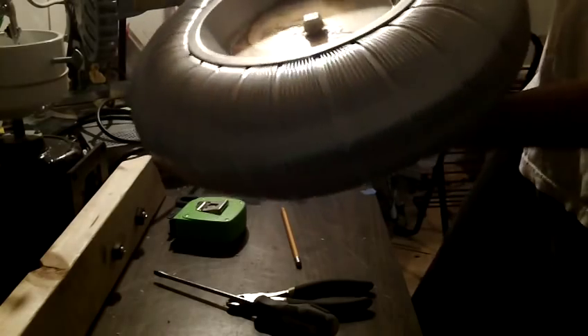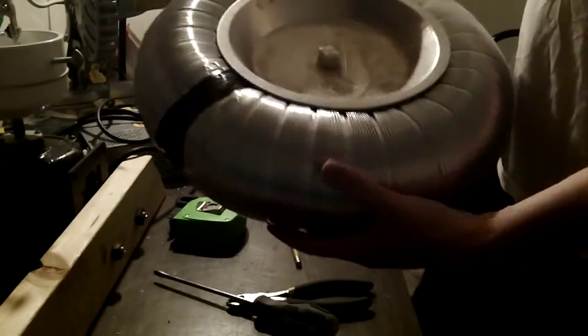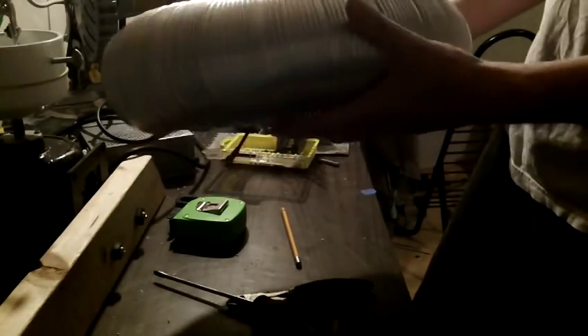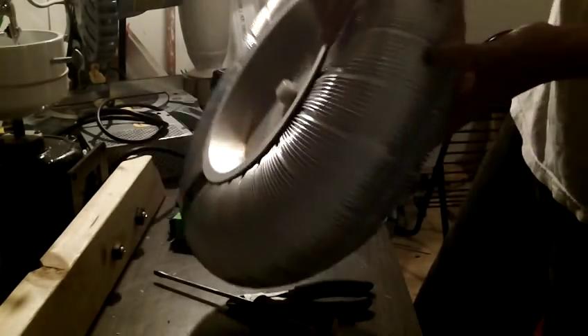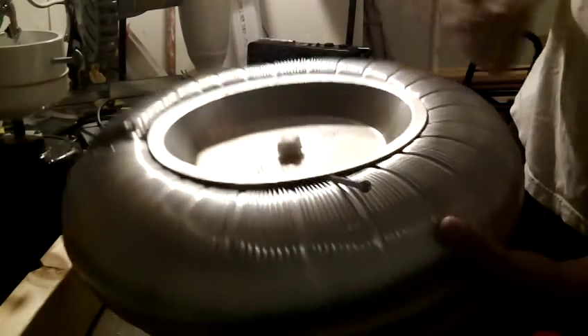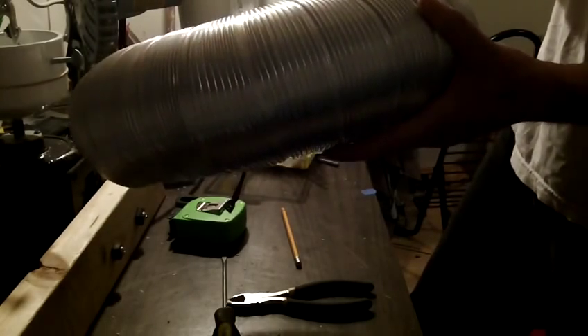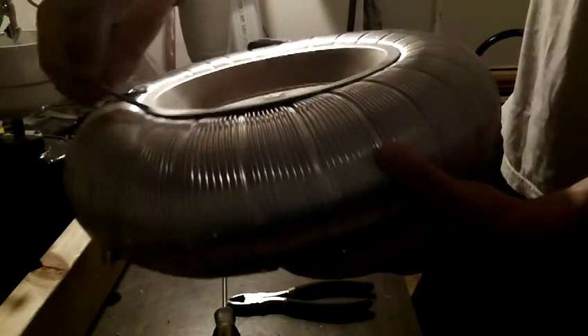It is not going to budge. If your toroid is misshaped, all you have to do is squeeze it in a little bit and it will conform to that pie pan almost perfectly. I've tried this out on my Tesla coil and I get two-foot streamers out of it — this thing really does a great job. There are small gaps here, perfect for placing little carriage screws. You can actually put a carriage screw in there, screw it in, and you have a fantastic breakout point right there. You can put multiple ones, a whole bunch of them all around.